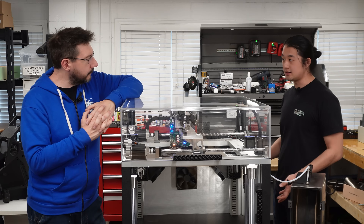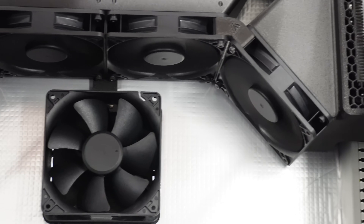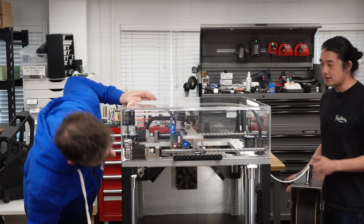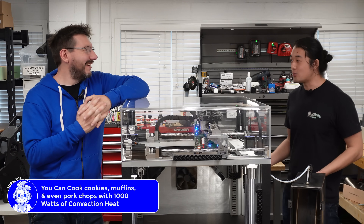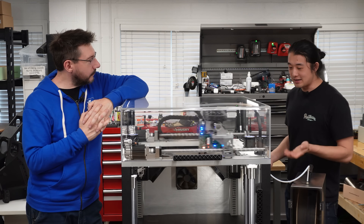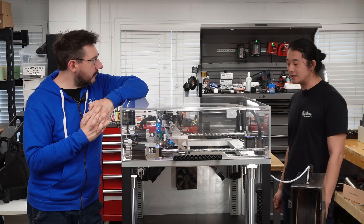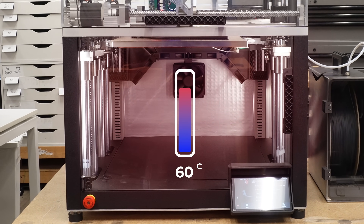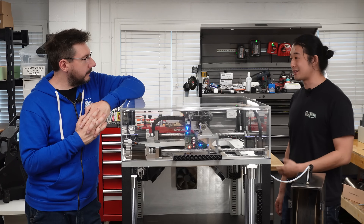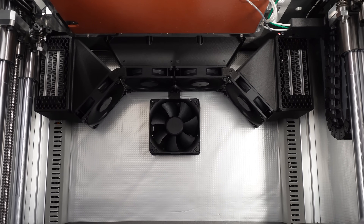We have a lot of air handling in the machine. If you look inside, the entire back — about six inches — is just fans and plenum. For heating we have about 1,000 watts of convection heating. We hate waiting, so it's great not to have a machine that takes 30 minutes to heat up. The chamber goes to 60°C, and with 1,000 watts it gets up to printing temperature for all our materials in about five to ten minutes from cold. We've got circulation fans as well.